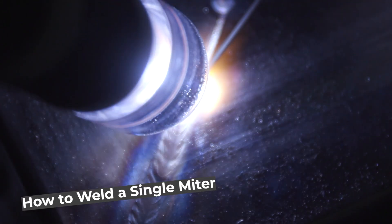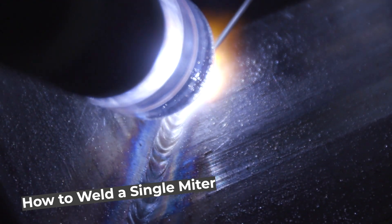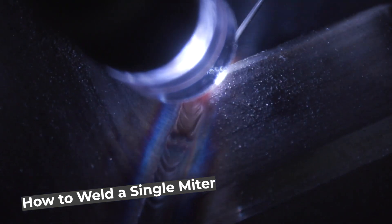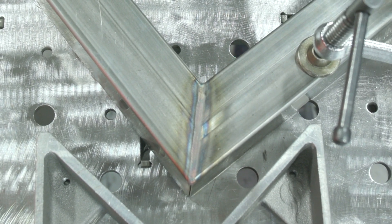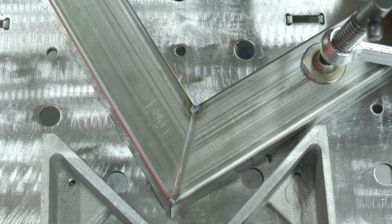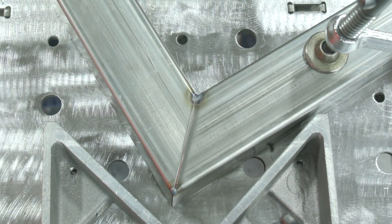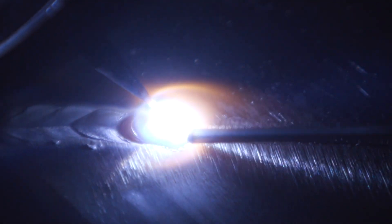As I'm welding, I'll weld around, and when I do my next section I'll start back about an eighth inch to overlap and go around, so it's not a trial to constantly wrap around the corners. For my welding sequence, I like to flip it over and do the opposite side first before I do my inside and outside corner — it gives me a better starting point to know it's not going to warp. I start welding over the tack, come across the top, and weld over the other tack on the other inside, so I end up double wrapping the corner.